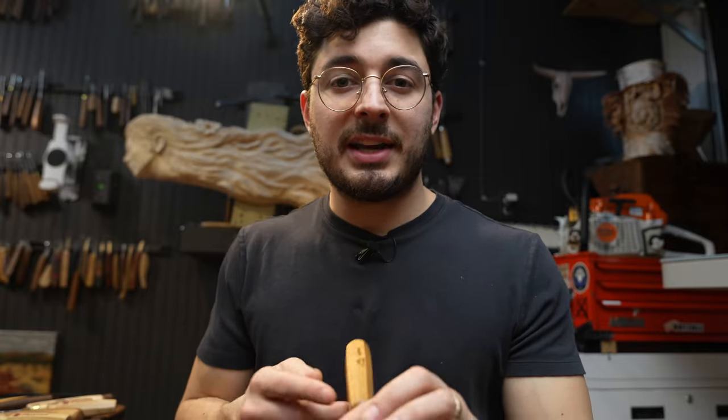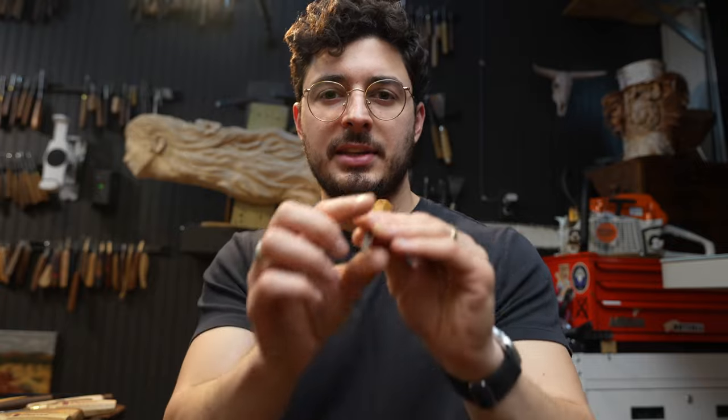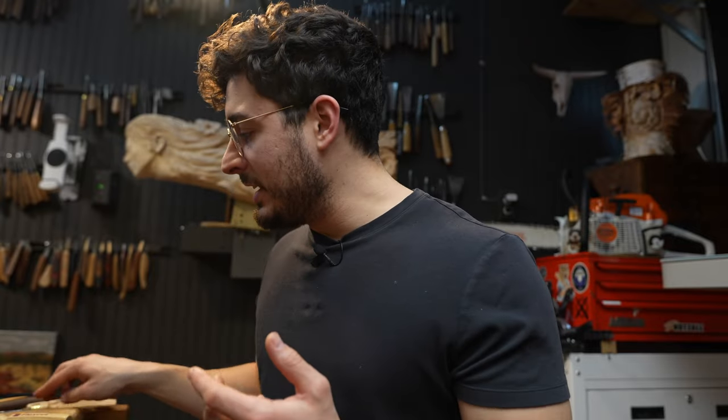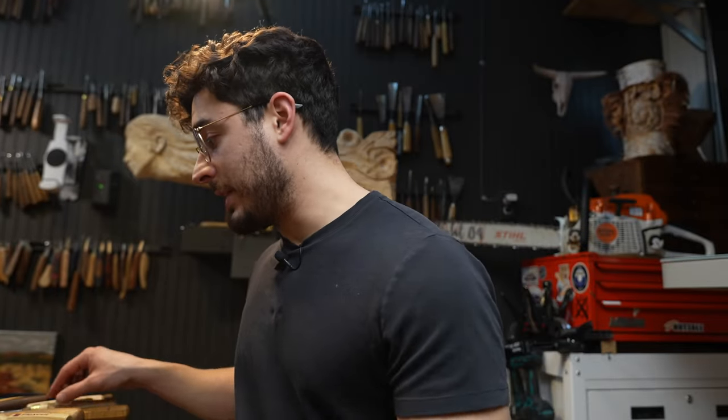V tools come in a number of different shapes and sizes. I tend to use the four millimeter and I like the 70-degree V tool — that means the V itself is at a 70-degree angle. You can also get 60-degree or 45-degree V angles. I tend to like the narrower V's because they get into tighter areas and are more versatile. Uses include opening the eyes, defining the upper eyelid, defining wrinkles under the malar bag, and opening up the mouth. As you progress in skill, you'll use veiners, skews, and knives more often for the same role, but the V tool is a great tool to have.